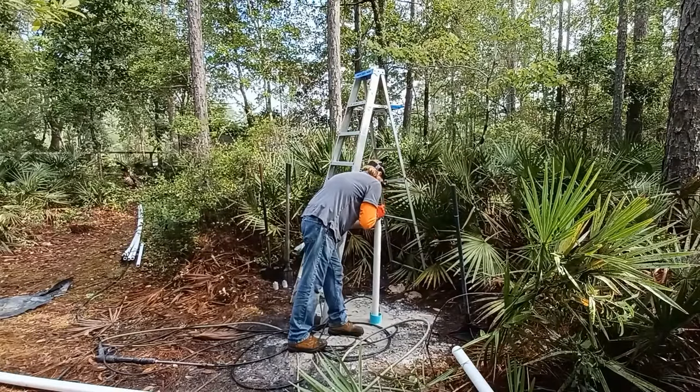So we are full. We have good pressure. It's holding in the tank at 30 pounds of pressure. Let me bring that GoPro over here. So you can see we're at 30 pounds of pressure, and it actually did shut off. So the regulator's working. This tank's holding pressure. Now the question is, are we down deep enough to be in the water? Are you ready? Okay, here goes.